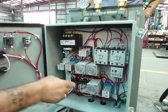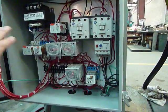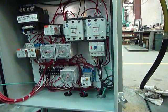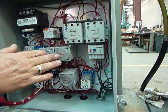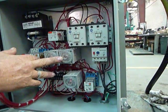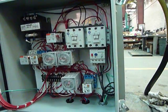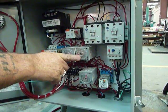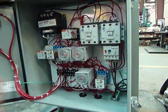You can go up to 10 seconds and it will be 10 times the value on your dial — whatever it takes. Timer two on this machine is one to one and a half seconds only. All this does is when the motor is going in the forward direction and timer one times out, timer two shuts both contactors off and the motor stops rotating. Timer three comes on and the motor rotates in the opposite direction. Once this is set, there's no need to touch it — it's just forward and reverse time.